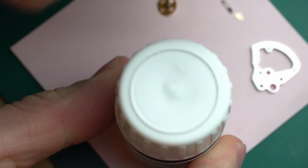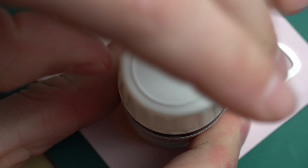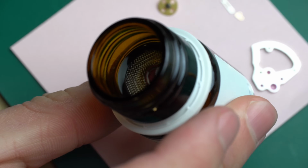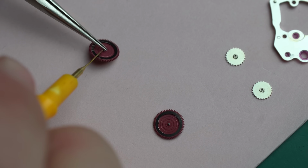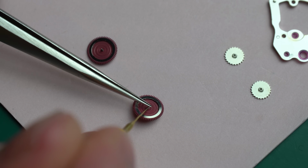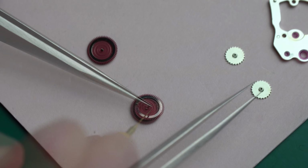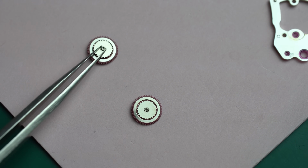Once again, Epilame all these parts, the reversing wheels are going in. Now we can let these things dry off before we reassemble this automatic module. Once again, a very fine amount of oil. This is HP 1300 going right onto the pivots, the base, and the top. Just so as soon as I put these things back together, there's some oil for these things to move around on.